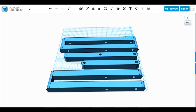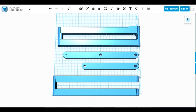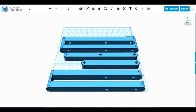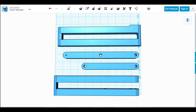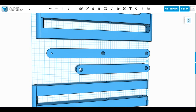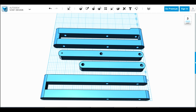Here are the pieces for the lever mechanism in CAD. The top and bottom are double pieces linked at the ends to keep both sides stable. The holes are tight tolerance for 8mm studding. The two shorter levers go through the middle, and one has a smaller hole at the end to screw in a roller that runs along a rail in the wood — which I'm yet to design. Let's print those out and see how well it works.